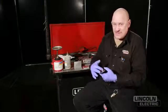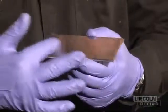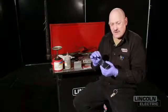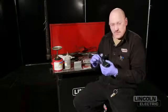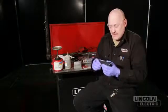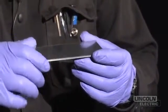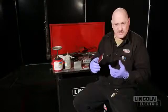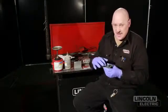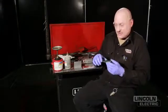For aerospace components and things, it would be acetone-cleaned and also probably scraped down or abraded to remove the oxide layer — because even though that real thin microscopic layer of oxide can be removed with the positive polarity of the arc, what's inside that oxide actually goes into the aluminum. Hydrogen is one of the things often trapped in the oxide, so it can go into the aluminum, and in liquid aluminum hydrogen takes up space, leading to holes or porosity in the weld. Some industries tolerate a little more porosity than others; some are more picky, so things have to be really clean in some industries.